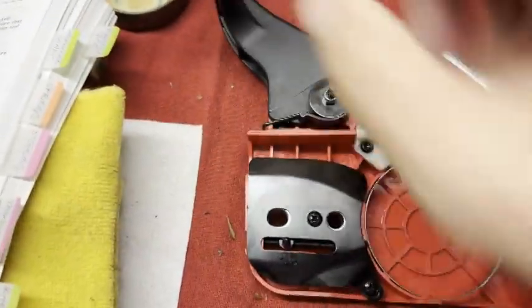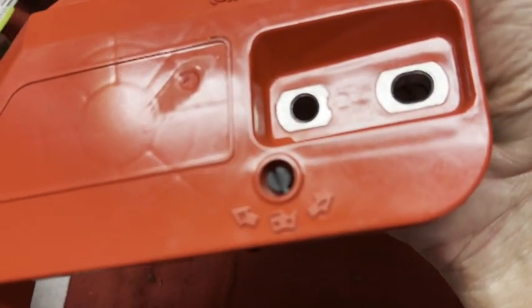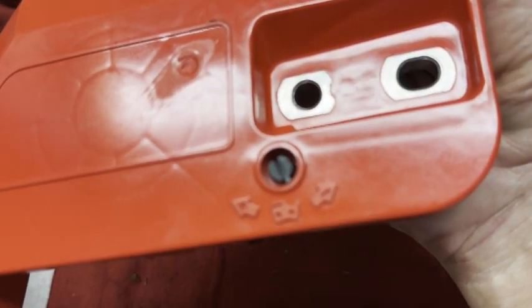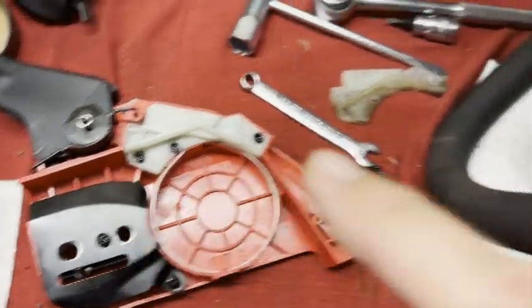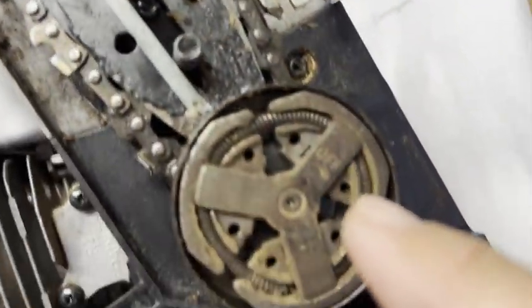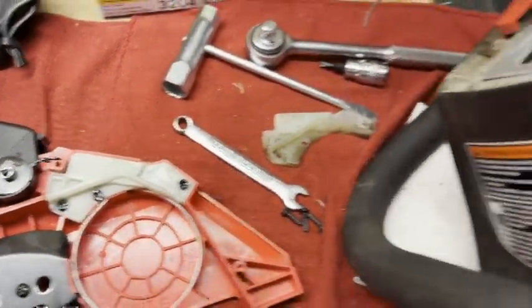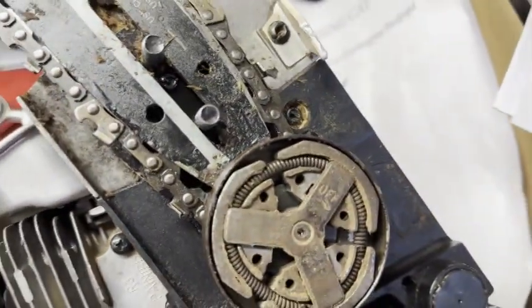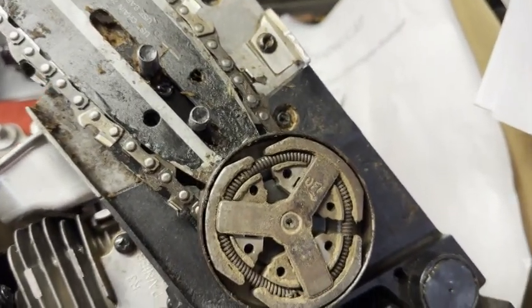To adjust or move this pin, on the other side of the cover there's a screw set that turns it. And you can see by the arrows whether clockwise or counterclockwise, tightening or loosening the chain. So what I'll go ahead and do first is move this pin so it aligns with this hole, put the cover back on with the chain brake off, and it should all fit in alignment.